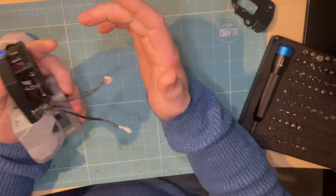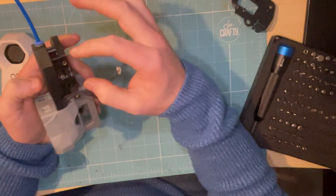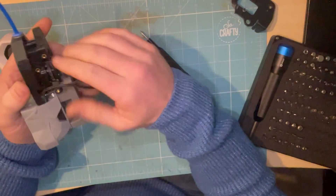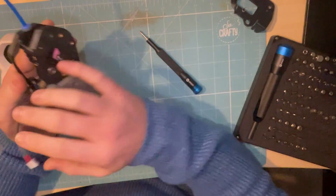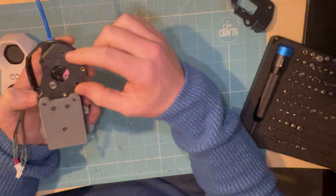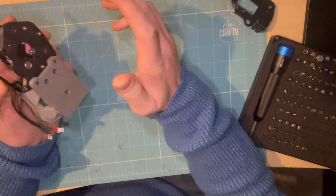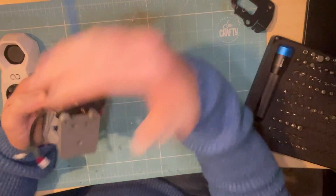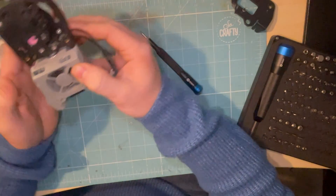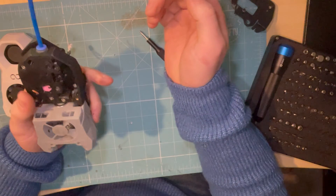Now for wiring. On mine I run CAN bus, so I've got an EBB from BigTreeTech toolhead board that sits inside here, and then it has a front board that controls the fans, the fancy LEDs, and whatnot. But when I first built this, what I did was mount my original toolhead board from the Neptune on the back. Going CAN bus is probably the best choice I've made on my printer - it means there's only four wires going to your toolhead, which all come bundled in one if you go with BigTreeTech.